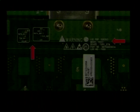Well, we could use those, you know, if we knew a bit more about how that plasma driver works, to see, does it have its clock? Can I put a scope on it or a frequency counter? Maybe I dive into it and I find out that there's supposed to be an enable signal that comes in on data in and then gets daisy chained out, data out. Well, I could maybe measure both of those. I might be able to take this and do something else with it. These things are like gold, and they save a lot of time.